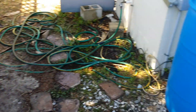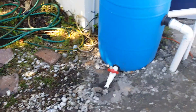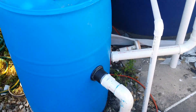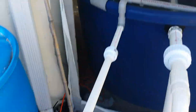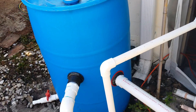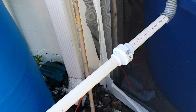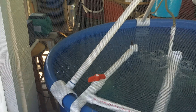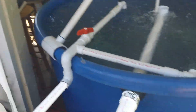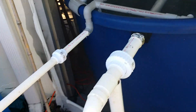The swirl filter is over here — its relief valve is down there. The piping is just enough to get from the main tank to the swirl filter. We've added some release valves in case we need to do work on the screen, and a turn on-and-off valve so we can control things when we need to take it apart or work on it.